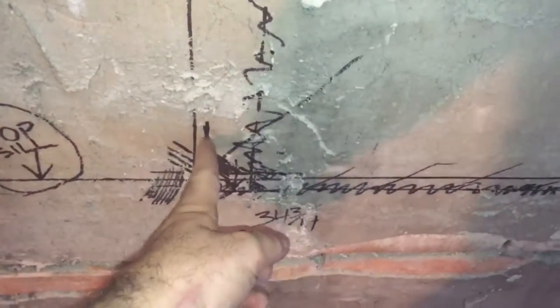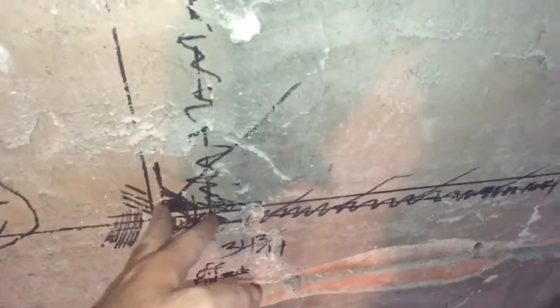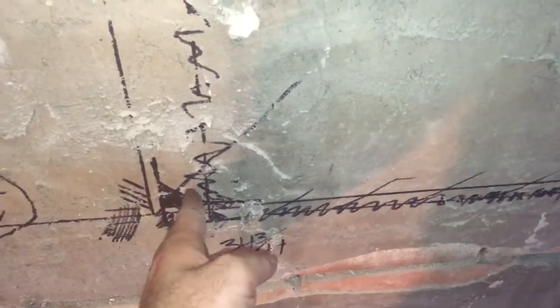The next thing I did was I figured out off of the new window locations, which as you can see, I've got marked out on the wall in Sharpie. I marked it out partly for the purposes of mapping out the paneling, but also the masons are coming to resize this opening, so I've given them all the measurement sizes. This is the edge of the finished brick, and this line here is the actual finished corner of the brick mold.